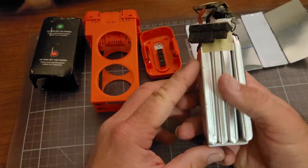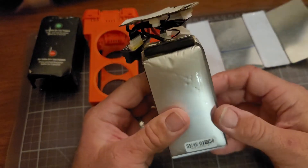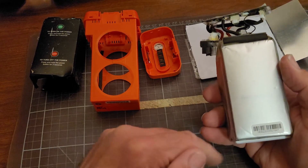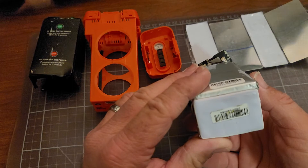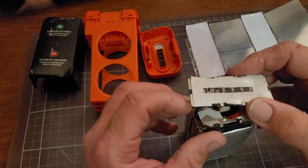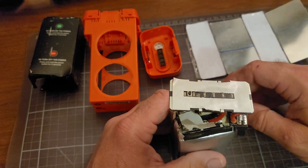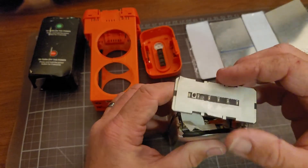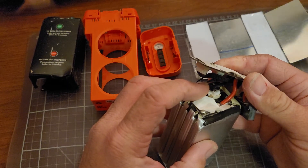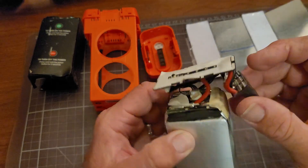These can cause fire and damage. Because these are charged I need to discharge them further before I finalize this pack. These individual LiPo cells have no information in terms of serial numbers or part numbers — just some kind of part number and sequential numbering on the bottom, but no indication of manufacturer, size, or voltage. Based on my research, LiPo cells are about 3.7 volts each, and four cells multiplied by that gives you 14.8 volts. Between the components you've got the main power connection to the battery cells, a balance lead that connects to the board to balance the cells, and also a temperature sensor that monitors the battery temperature.